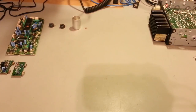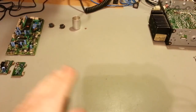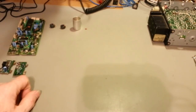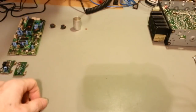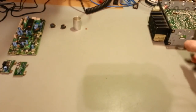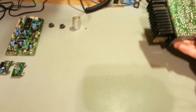I'm going to make the title of this video something like 'Get the Glue Out.' Any of you that have watched my videos know I'm always preaching about the most important things you can do to a radio — any radio, electronic CB radios, export radios. This stuff has been used in most all electronics for decades, and as it ages it becomes corrosive and conductive.